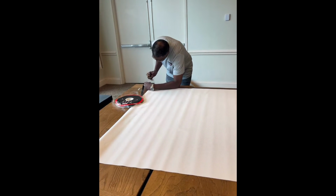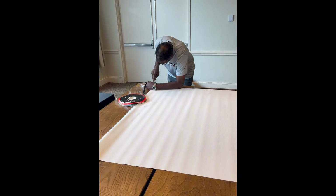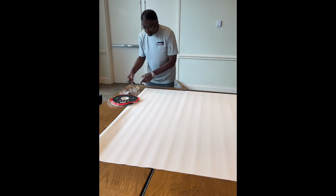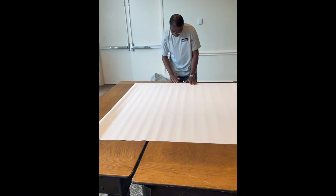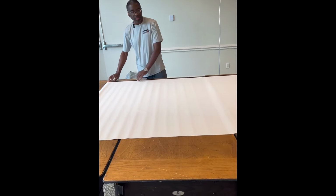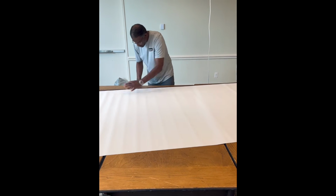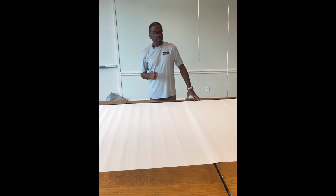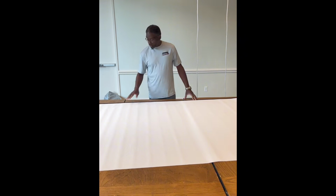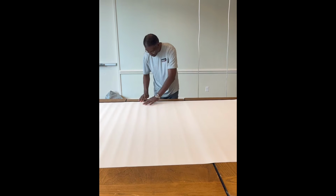You've got to be careful you don't cut yourself. Just cut the tape. Pull that off, and all you've got to do is make it flush with the cover like that. So once you have that in place, it's PSA, pressure sensitive adhesive. This is acrylic tape, so just go along the edge and press it down. Make sure you're getting a great bond. Now, this is acrylic adhesive and it has a high tack rate, but it cures in 24 hours. The initial tack is 70%, so you've got a 70% tack right now, and after 24 hours, it fully cures to 100% tack rate.